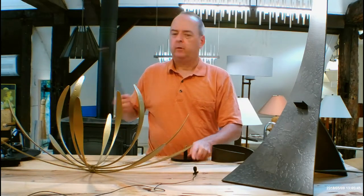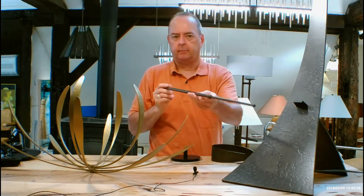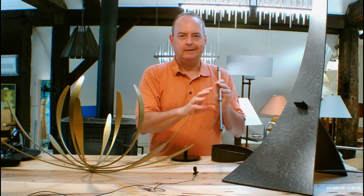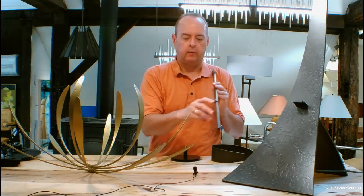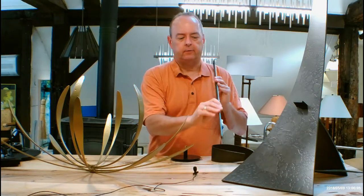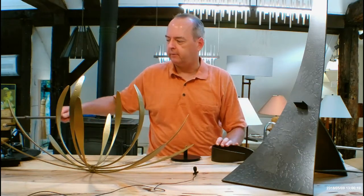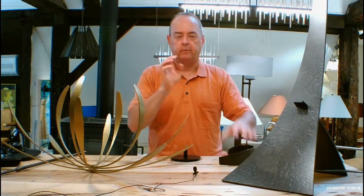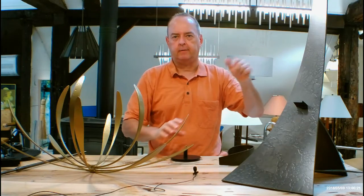Same deal with all the telescoping rods that Hubbardton uses in their pendants, they didn't need to be heated up as well. So when you look at that chart and you see the A's and the B's, the things that didn't need to be heated up to be heavily forged are going to be more consistent with the B for boy most of the time. Remember, there's a range of variance in all this. So most of the time they're going to be more consistent and more uniform. Meanwhile, a lot of the heavily forged pieces may, most of the time, have that kind of mottling. So that's what you see in that picture on the chart, in those three larger images when they have the A's on them.